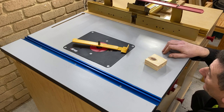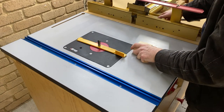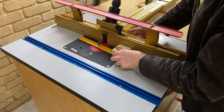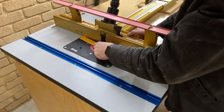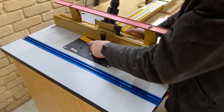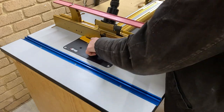I'm just going to lower the router a bit so everything's flush. The next step is to bring up the router fence. You don't need an Incra router fence for this, anything will do, just as long as you have some fine adjustment — that's the important thing. So there we go, that theoretically now is centred.